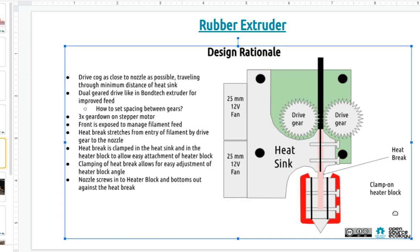So that's interesting. I didn't think about that, but since the guys brought it up and it seems like they know what they're doing, it's definitely worth trying. I do like it because it's not easy to thread when you have wires on this heater block, because you've got the heater element inside the heater block and the thermistor. Threading that in for all that distance takes time. You have to pay attention to where your wires are so you don't break them. So just slipping it in would be a really good way, and you just clamp down some bolts.